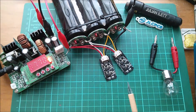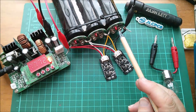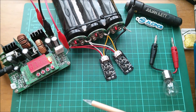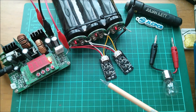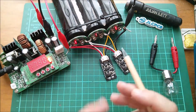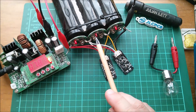That didn't take long — this one's coming on, that one's coming on, and the balancers seem to be saying no balancing is required. The middle one should come on pretty soon. I can't see any glimmer from it yet, but these aren't saying that balancing is required. I can't believe it's within 30 millivolts really — these probably have hysteresis, triggering above that threshold and turning off below. I need to look up the specs. And there comes the light on the middle one.